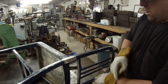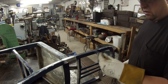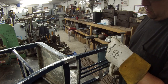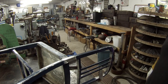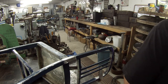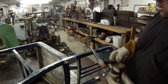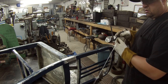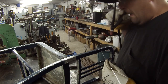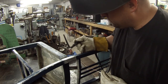Okay, here we go. I'm gonna start with this crack on this side here. I got two rods. This is a 1/8, that's probably way too big. I got this other one here, I believe this is a 1/16. Got the machine set on AC, high frequency. Done got me a ball on the end of the tungsten there. Let's see if I can weld some aluminum.